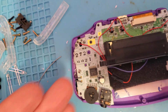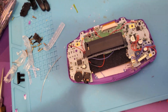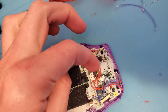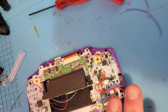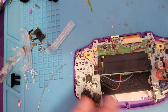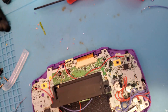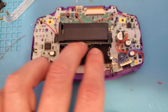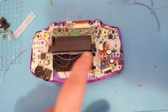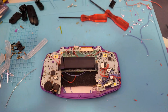The ones on this side are wired up on that S2 point — though I realize you probably don't actually need to use S2, because I'm only getting 1.5 volts from this one and it seems to be bright enough. On that S2 pin I was getting five volts, and on all the other pins I was getting about 3.2 volts, so that's at least double. It should be enough either way. Let me put the back on, turn it on, and see what we get.